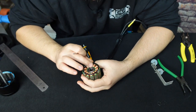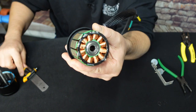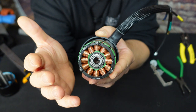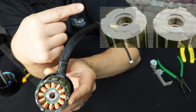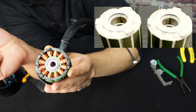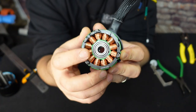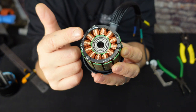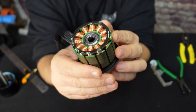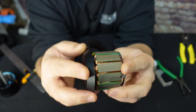I cannot see much battle hardening on the coils themselves, but normally you don't do that anyway unless you have really exposed motors. For comparison, the Rich Motors have a crazy level of battle hardening — 3D Services and I did that together. Each strand is lacquered, which it must be, otherwise it will spark up. In general it's actually quite neat. The shrink wrap for the phase cables does go all the way inside the motor, which is good, and it's quite sealed.